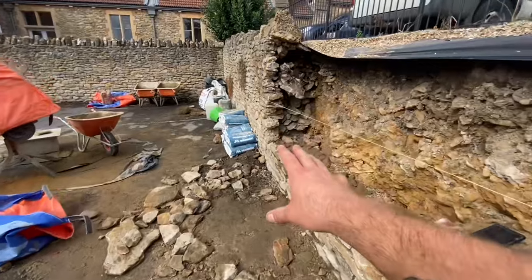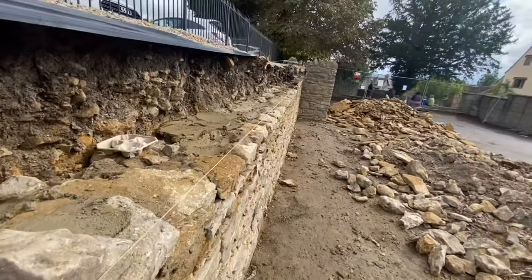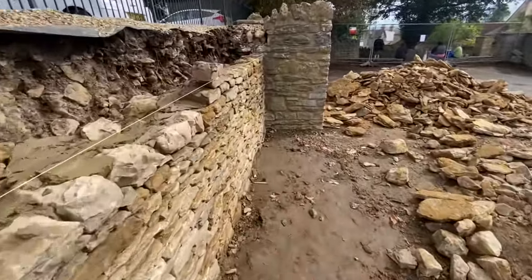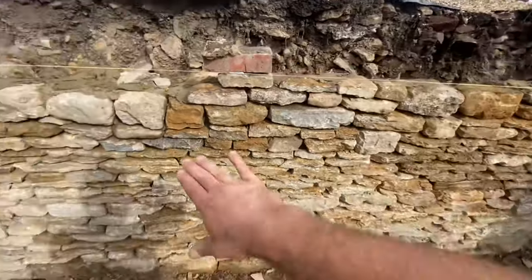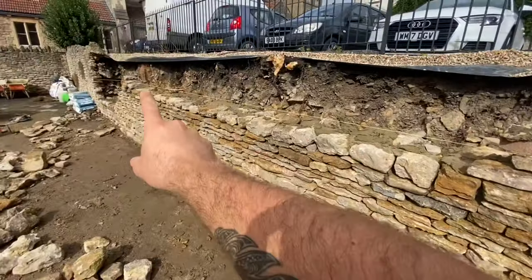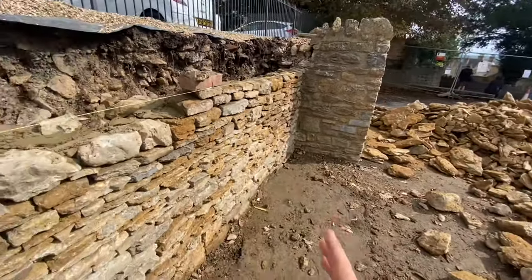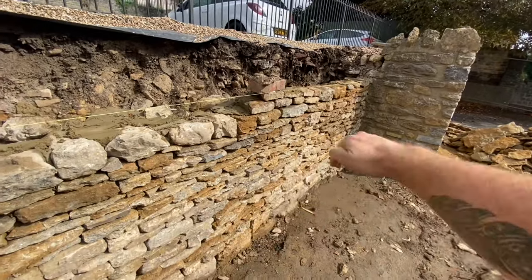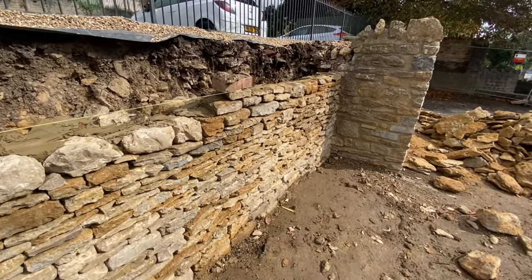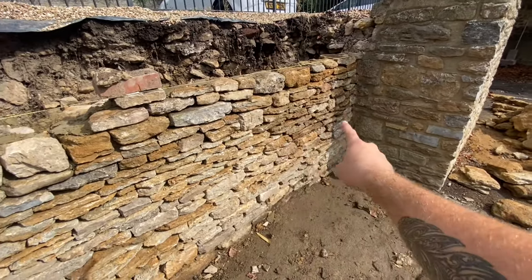So we've had a few collapses on this side. We're just really pumping in a load of mortar in there, mortar and stone, obviously lovely and straight down here now. That's the only thing, I probably personally went a bit too high because I was stepping it back. You can sort of see what I've put in today because of the dark section, but really shouldn't have gone as high as that, because you've got to just keep checking your levels basically. It's better off just leaving a little bit, like three or four courses.